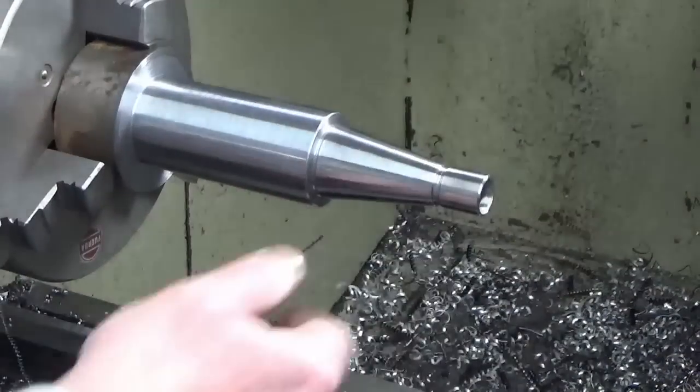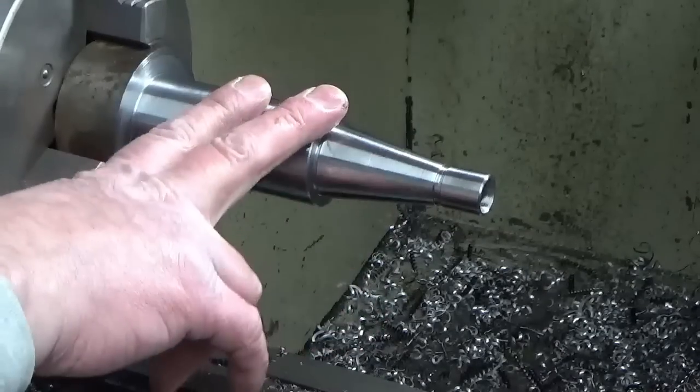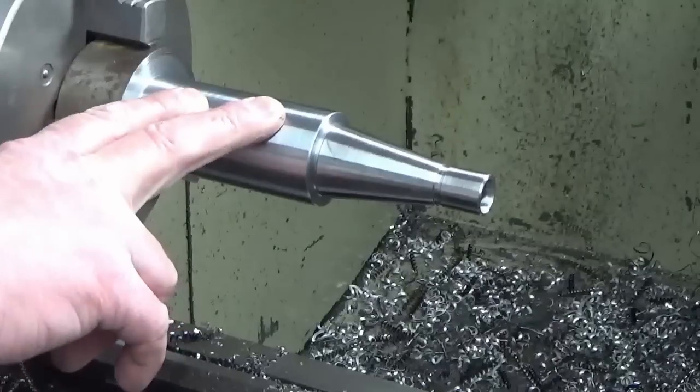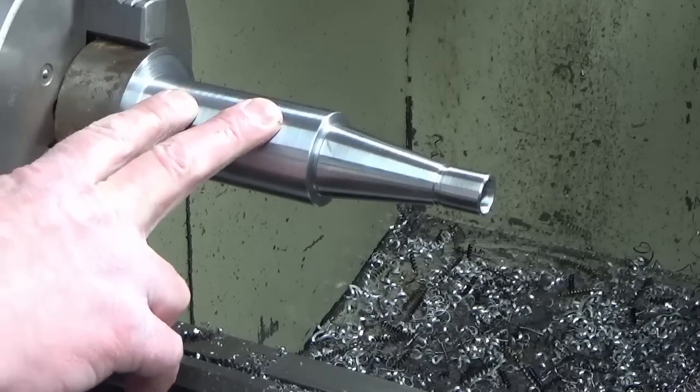Okay, that's got our first op done. So what we're going to do now is take that out of the three jaw. I'm going to switch the three jaw over for the four jaw. I'm going to get this set up in the four jaw, and I'll bring you back when we're doing the second end,